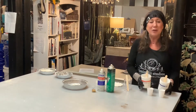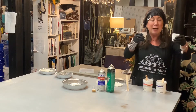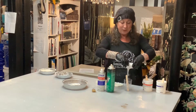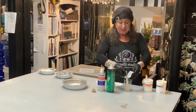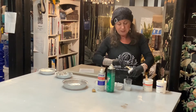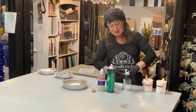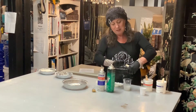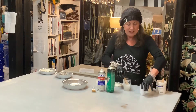I'm using silicone rubber that comes in part A and B. I have two measuring cups that have been weighed out in equal volume. I'm going to pour them into my mixing container and scrape them out to make sure that I get the exact amounts, otherwise it won't cure very well.